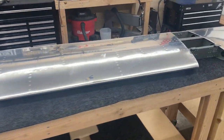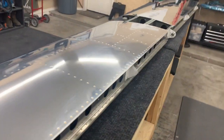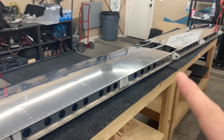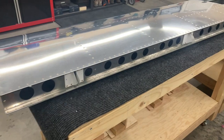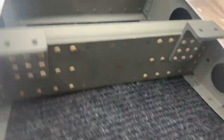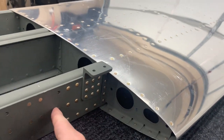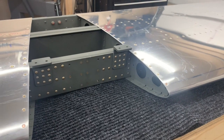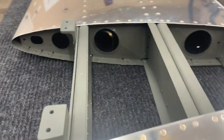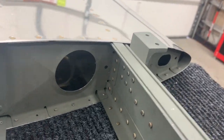Here is the finalized part — really pretty, really happy with the results. This is the horizontal stabilizer, finished up yesterday. My wife Amanda was able to do the pop rivets on all the basically internal ribs, and then I was able to squeeze the rest of the rivets, and had to buck a couple as well. On this front spar, there were rivets here and here attaching to the nose ribs that weren't accessible with the stands I made. The instructions said to wait until the end after it was fully completed to get those done if there wasn't room. So sure enough I had to buck those — they were the bigger 1/8-inch rivets, which were always a joy, but happy with how it turned out.